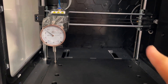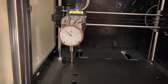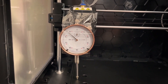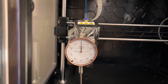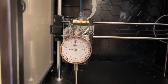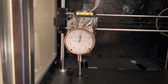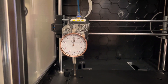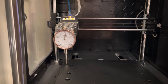On the right side it's low, in the center it's high, but on the left side it's even lower. However, when we move back and forth on the Y-axis, you can see it's at around 86 there, and if we move backwards the needle is barely moving. Just for a sanity check, let's do this again — Y is going to come forwards and we get about 3 thou of difference, which I'll throw the conversion to millimeters on the screen. If you continue moving on the Y-axis too far forwards, you can actually get the stepper motor to jam, so you want to make sure you don't go too far and hit the limits.